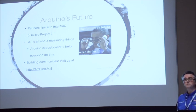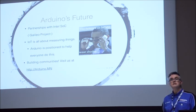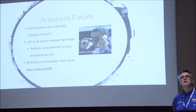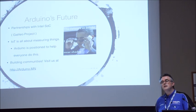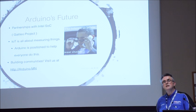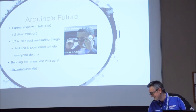And that's pretty much it, unless we've got any further questions. Not a question as such, but a problem with the new version of Arduino and the IDE. You have to change to the legacy bootloader to work with the Arduino. Yeah, I think they're changing the bootloaders on the genuine Arduino. If you're using clones that use the CH340 driver, you have to use old bootloaders. Version 1.8.9 will also work, which is changed to the legacy bootloader. Okay. I was tinkering yesterday morning. Probably my problem then. You don't find it because you've got genuine Arduinos. You buy cheap knockoffs, yeah.